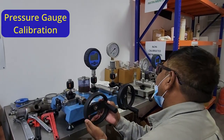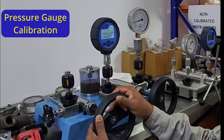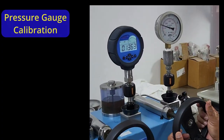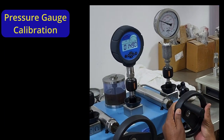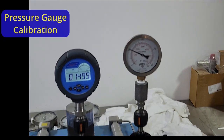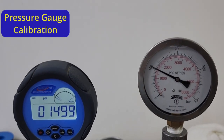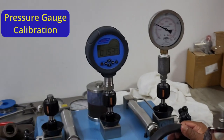The target gauge here is 6000 PSI. We will go for 25%, which is 1500 PSI. So we have reached 1500 PSI at 25% — you can compare with the gauge. This 25% rising is already calibrated. Now we will go for 50%, which is 3000 PSI.